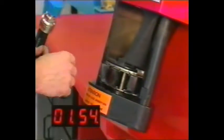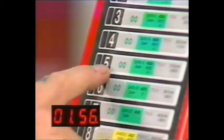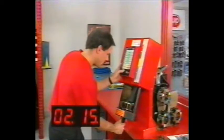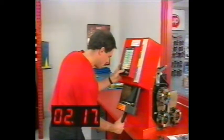Insert the die into the crimper and set it according to established crimp specifications. Insert the fitting end into the die cage and align the scribe mark with the end of the die. Also available are locators, which can be mounted in ProCrimp 1380 die cages to simplify the proper location of the fitting in the die cage. Actuate the jaws and crimp until the crimping process is complete.